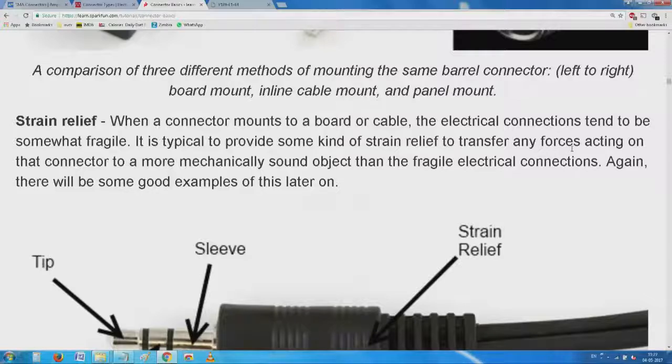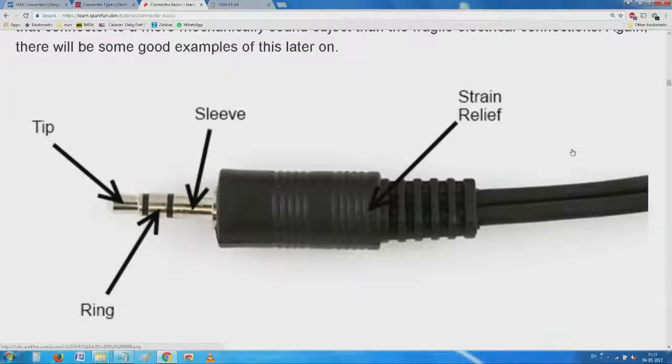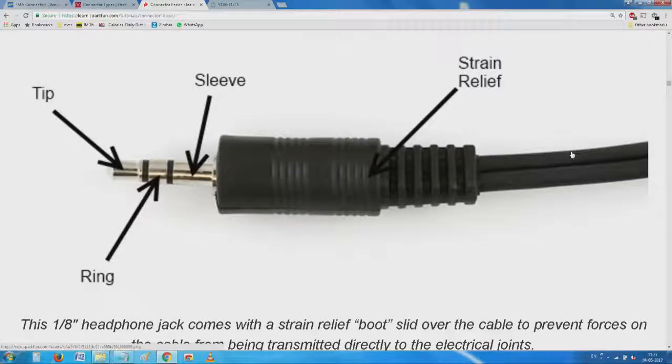So I am sure all of you know about this 3.5mm cable jack which you use in your headphones. Very interesting. This is taken from an old telephone, where you have a quarter inch, 6.35 mm. The terminology you have seen there, the tip and ring, was carried through in the POTS, the plain old telephone system, and the words tip and ring are even used in the electrical circuits. This is the only place where they clearly explained what a tip and ring is.